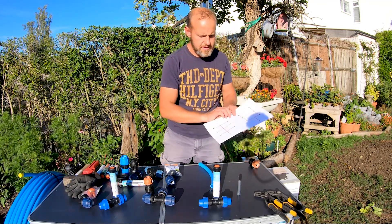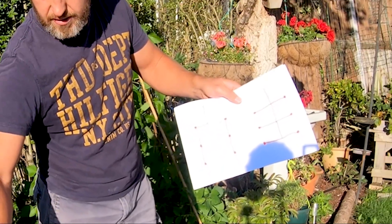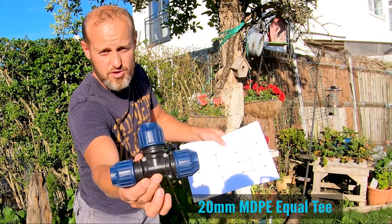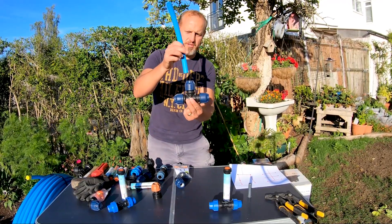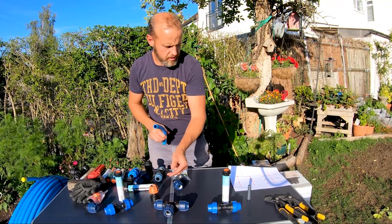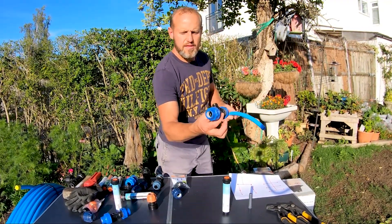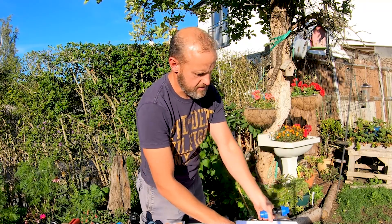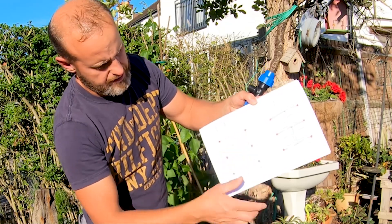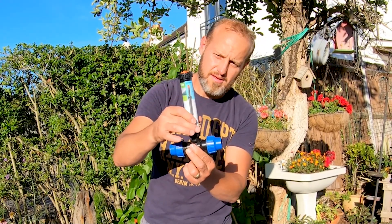So when running down a branch, coming down and doing one of these branches — when I get to the first junction I use a T fitting, a 20mm T, to do the initial branching. I'll run my inlet pipe from the pump into the top of the T, branch off here and start the system from there. Getting to the first connection, we use these little compression branch Ts with a male thread — I think this is a half-inch male thread — where your pipe comes in each end and carries on to the next. So the pipe comes in, goes out, and your pop-up sprinkler sits in the top.